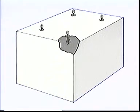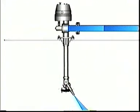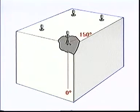Water or oil is pumped through the guns at high pressure. Normal working pressure on this vessel is 8 to 10 kilograms per square centimeter. It is the revolving jet inside which cleans the bulkheads and tank bottoms. With this type of gun, the speed of rotation depends on the pressure. At a pressure of 10 kilograms per square centimeter, the speed is approximately 2 revolutions per minute. Elevation range is from 0 degrees to 150 degrees.